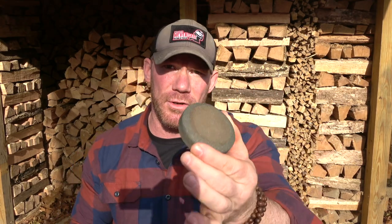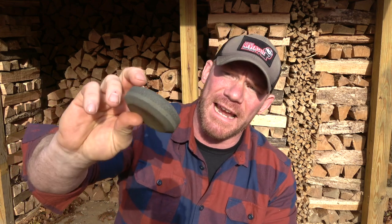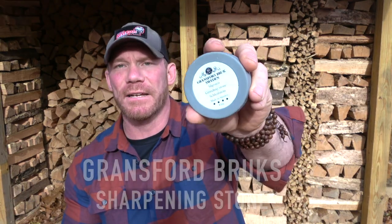Outside of that, regular maintenance for your blade can easily be done with something like a Lansky puck — that is nothing more than a whetstone you can use with water or oil. I personally use nothing but water with all my whetstones because if you use oil you can't really go back to water, so I keep it as simple as possible. This is basically a hockey puck sized sharpening stone with one coarse side and one fine side, and you work the blade in a circular motion. If you need to know how to sharpen, please watch someone more experienced. However if you want to step up your game, last Christmas I got the Gransfors Bruks sharpening stone, which is a step above the Lansky puck — even the coarse side is finer than the Lansky's fine side, so you go from coarse to extremely fine. Typically I will start with the Lansky puck for a rough blade and then move on to this, but otherwise typical maintenance goes coarse side to fine side and then I like to strop my axe blades.